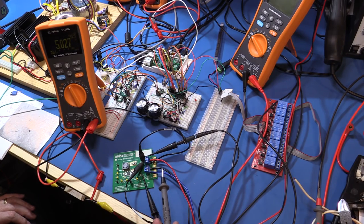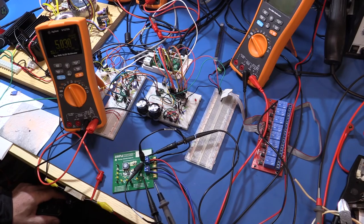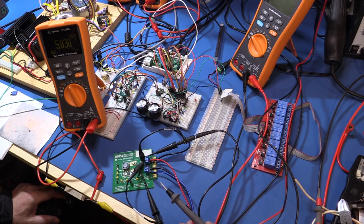I'll have the three and a half digit multimeter on my oscilloscope monitoring the output voltage, and I'll hook up one of my four and a half digit bench digital multimeters as well. For this circuit, the four and a half digit is probably going to be more than accurate enough. When we start checking the switching response — response to switching the load or the input voltages — the oscilloscopes will be better to see the transients. We'll put it to AC coupling and look for transients when we start switching things around.